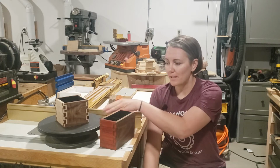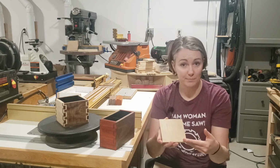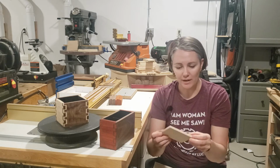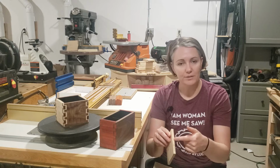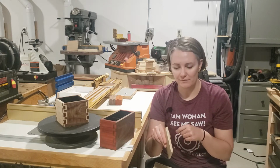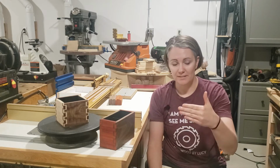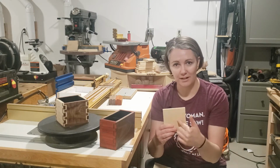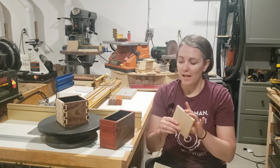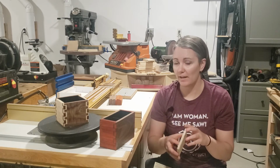that happen. But when you look at a piece of wood, the face grain is always going to be the most beautiful side. The edge grain is also very pretty, and you can still see figure in it. But the end grain, you're never going to get any of that figure. It's always just going to be kind of dull. So on a normal box joint, what you're typically looking at from the side is face grain, end grain, face grain, end grain, okay? And so every part of it, there's going to be half of it that's just not quite as vibrant.